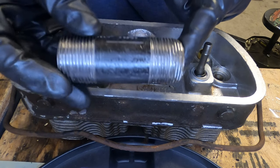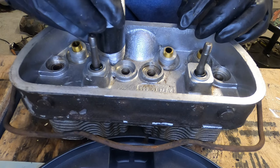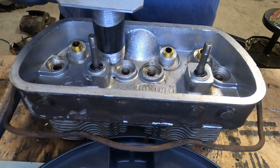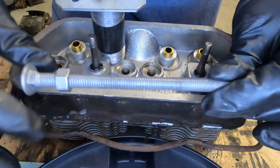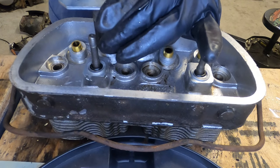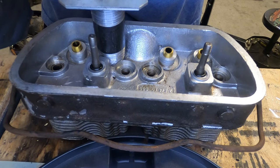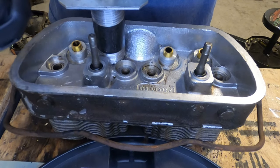Now that the valve guide is tapped, take that 1-inch by 3 and a half inch steel nipple — with the threads ground down so it fits better where the spring is — and set that on. Then take the piece of angle iron with the hole in it, set it on, and add the washer and larger nut. Take the carriage bolt, put the 3/8 by 16 nut on higher, slide it in, pull it up so you can see the threads, and start screwing the carriage bolt into the threads you made. The top of the carriage bolt takes a 3/8 box-end wrench — tighten it down and go in at least about a half inch, or just go until it doesn't go anymore.